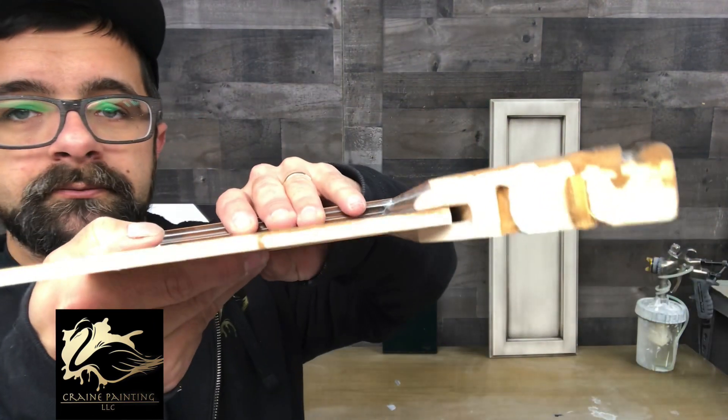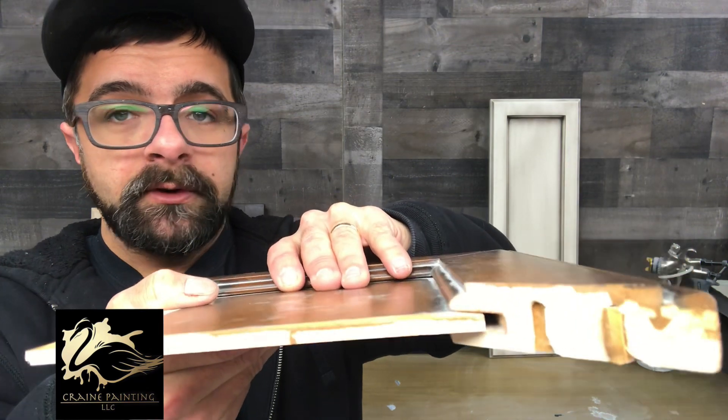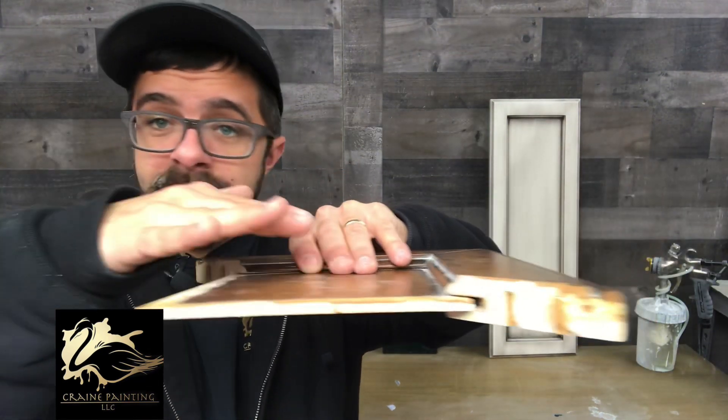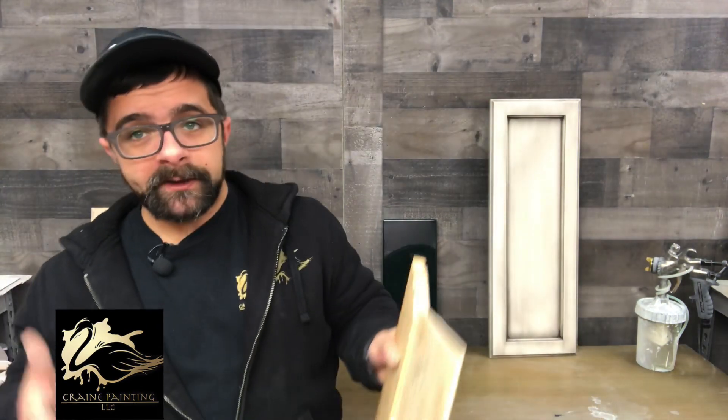You can see that there's still a little bit of room for this panel to give and take, because this absolutely does move. Wood sucks in moisture and it lets it out. So during the year and the temperature changes, it's going to move.